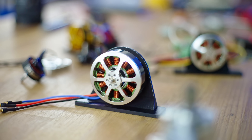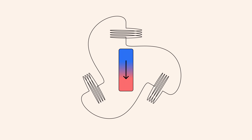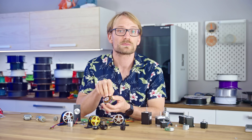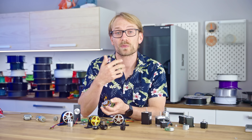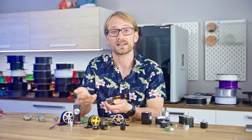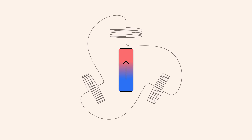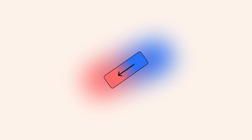A brushless DC motor works in much of the same way. The big difference is that instead of two separate coils or two pairs, it uses three coils wired up to each other, and by powering one of the coils, you're also partially powering the other two so that they can work in tandem. You can totally run a brushless DC motor with a fixed step sequence, but just like hybrid stepper motors, the way they are built today is optimized to work with a modern driver setup instead of catering to the specific needs of some outdated control scheme. The windings and how they're wired up is just a means to an end — ultimately creating a magnetic field that forces the rotor into the position we want it in.